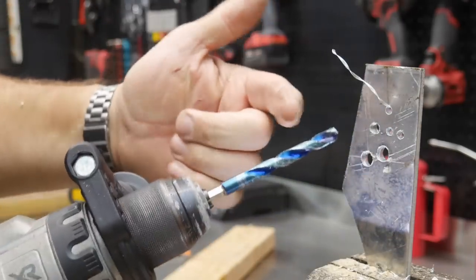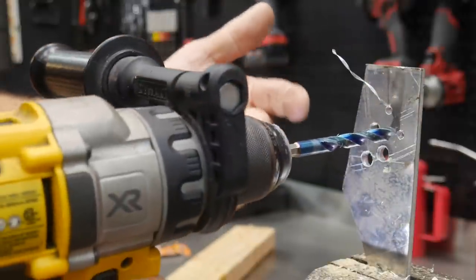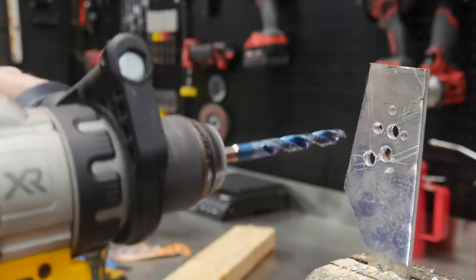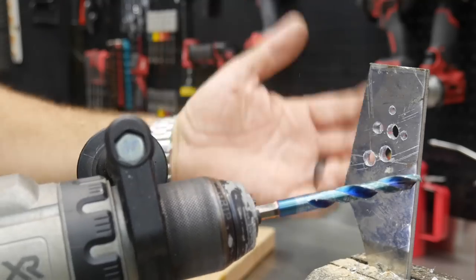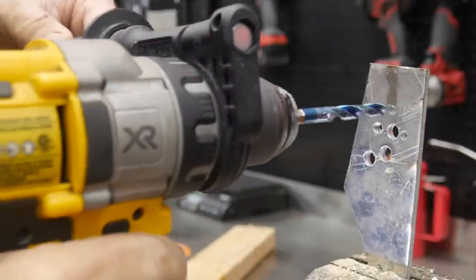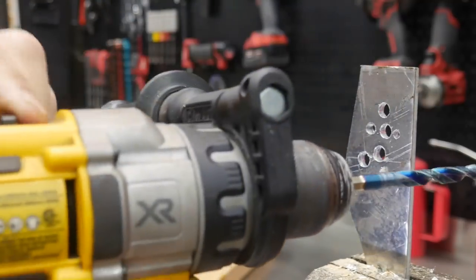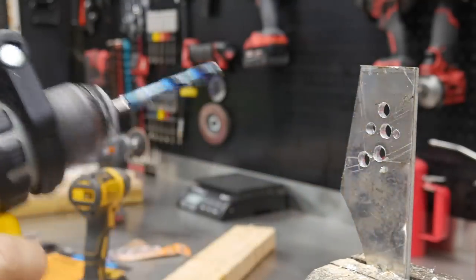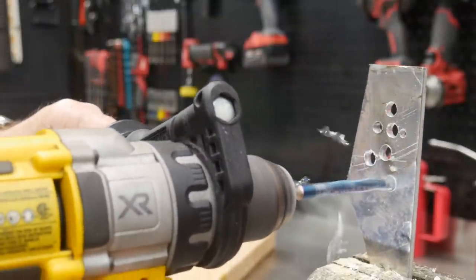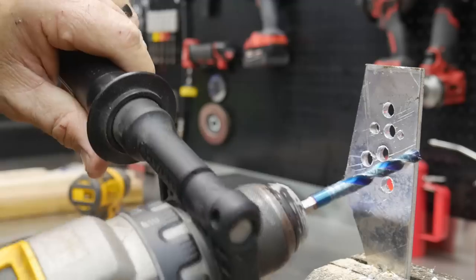The nice thing about a split tip design versus a drill tip is that now that we've already got a pilot hole, it will center on that hole if we want to open it up. A drill tip won't do that — it has that little point on the center, and if it's not centered in the hole it's going to walk all over the place. So that split tip design helps you center and keep it centered. Still cutting big chunks, not just burning through. Let's get some different material in here — going to go to some layered steel.